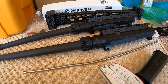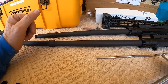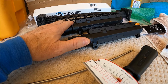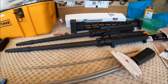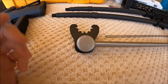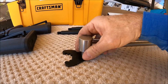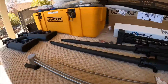We're going to call this good for today — this video is going to be plenty long enough. Tomorrow we'll get the gas block on, the gas tubes in, and actually put the hand guards on. I did have these tightened and loosened two or three times figuring out what size shim I needed, so the threads did get seasoned. Also note: if you put your torque wrench at a right angle it does not change the torque value, but if you extend it lengthwise you're lengthening the leverage and that will change the reading.